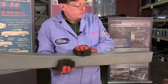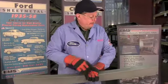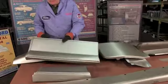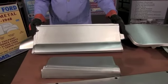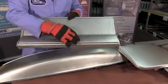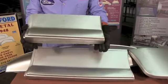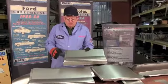That gets tack welded on. This centerpiece goes from the front doorpost to the rear doorpost. There is another section that goes behind the cowl and an additional section that goes behind the quarter panel. You pick whichever ones you need because they're all rot. Speaking of the quarter panel, EMS Automotive die stamps the rear lower quarter panel. This is your rear doorpost, your rear fender area. We stamp in your corners, your door jamb, roll underneath — all this shape, die stamped. This is for your business coupe, the long one. We also have the short one for all your two-door sedans and club coupes, which had the bigger door because it had a back seat. All your shape, 18-gauge steel.